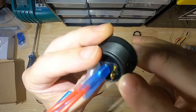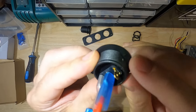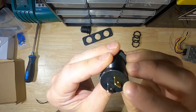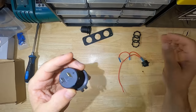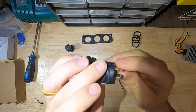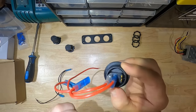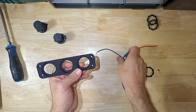If you look closely on each module — the switch and the two adapter outlets — you will find a positive and a negative. On the switch, the negative is actually the gold pin. But if you look at the USB module, the positive is the gold pin. So don't assume the gold pins are always going to be negative or positive because they'll be reversed. Just look for the negative and positive symbols on each module.